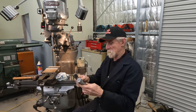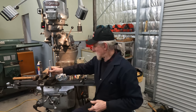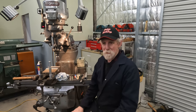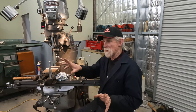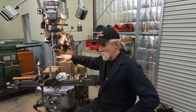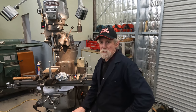that will be good. So anyway, I better jump on the computer and go searching for a number 10 DP cutter, or price one up, and we'll go from there. I mean, the other option, if I had a tool holder for the mill, I could grind up a single point tool and do it that way, but we'll see how we go tracking down a cutter first.